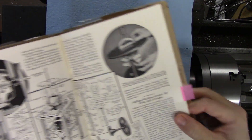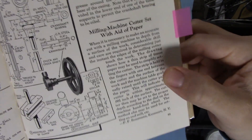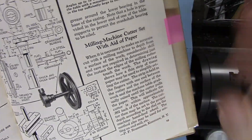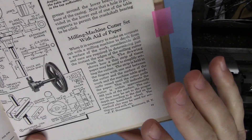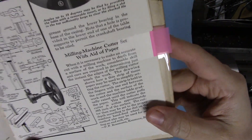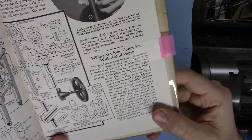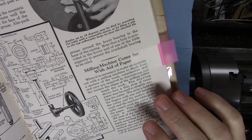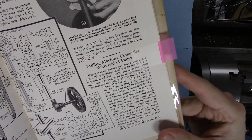The last thing I had tagged is a 1940s reference to the paper trick. The paper trick is when you use paper to find the end of an end mill or cutter and use that to set it without touching off on the part, which would scratch your part. I've actually got a video planned pretty soon where I test out the paper trick to see how accurate it is, and I'm going to be testing different types of paper to see if it has an effect on the accuracy at all.